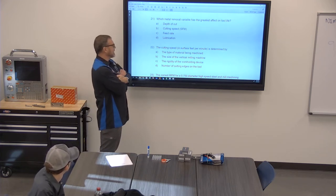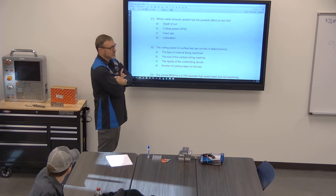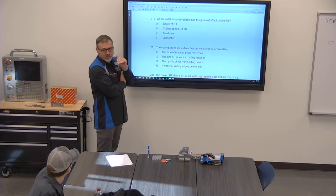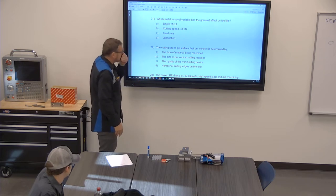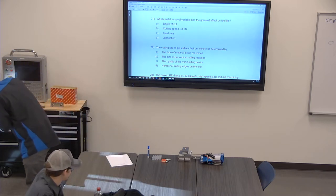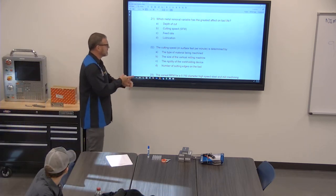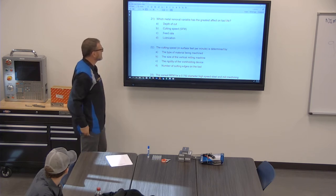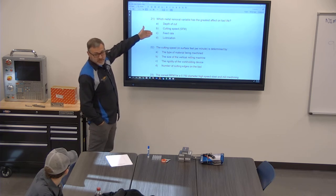Gosh, I don't know. If you go too slow, I don't think that has as big of an adverse effect on some of those other things. You can dull a tool out pretty fast by going slow, but that's not primarily what you have. Normally a tool is breaking because I've got too fast of a feed rate or too heavy of a depth of cut. I guess on some of those things it could go the other way. Too light of a cut doesn't really affect it.